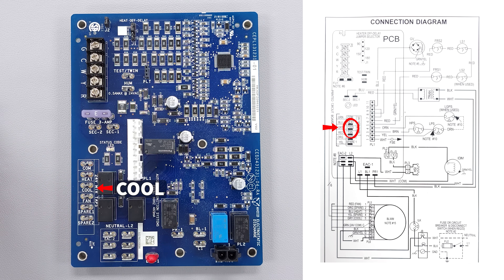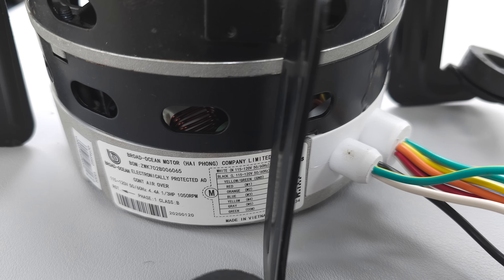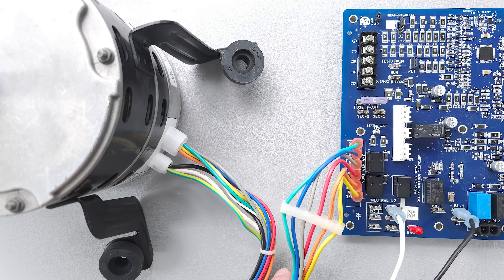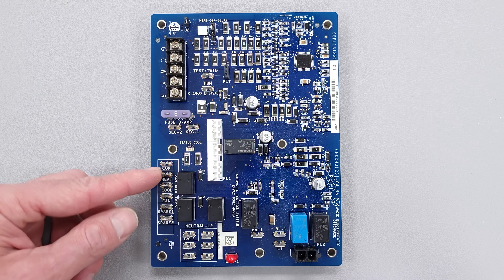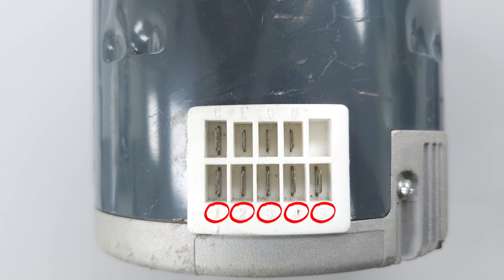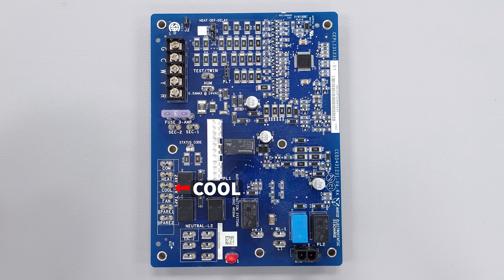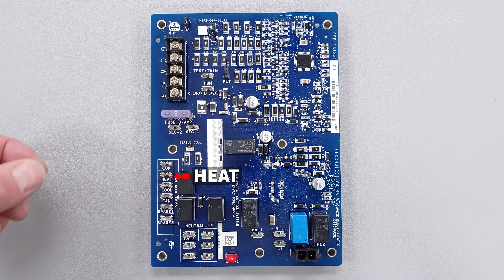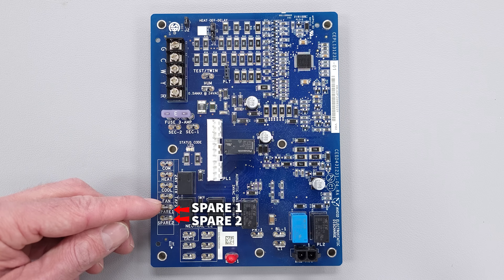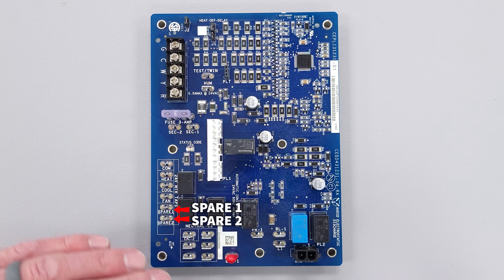Maybe the cool tap is connected to terminal number five and the heat tap is connected to say terminal number two. Depending on what kind of blower motor this is connected to, it could be connected to a Broadocean fan motor where you just have wires coming out of the motor module and connecting over with speed taps. Or you could have connectors going over to a Genteq X13 fan motor, which then has numbered pin connectors one through five. The cool tap is connected to what will be programmed on the fan motor as a higher fan speed, the heat as medium fan speed, and the fan probably as the lowest fan speed. A couple other terminals from the fan motor are connected to spare terminals which are just parking spots so there's no back voltage or shorting of those extra speed tap wires.